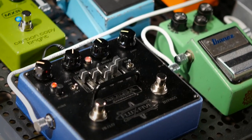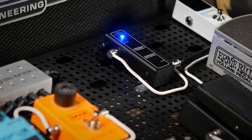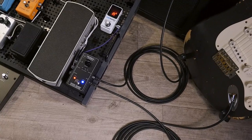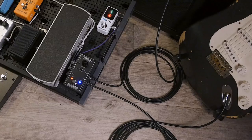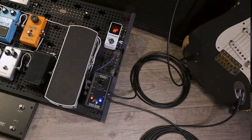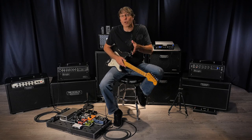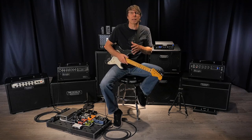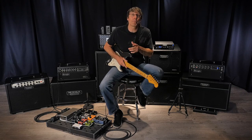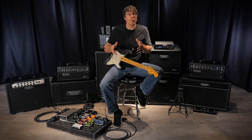is pedals. Some pedals, even true bypass pedals, load the pickups undesirably, so the first connection from your guitar's output is crucial. Placing a Stowaway or a Highwire in front of your first pedal provides your pickups with the consistent loading and the impedance match they want, while the buffering converts the signal to low impedance, and this makes the signal throughout the pedal board no longer susceptible to the pedal variations. The bottom line, load your pickups correctly and the connection between your hands, your instrument, and your tone is enhanced and elevated.